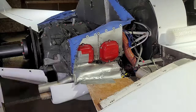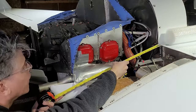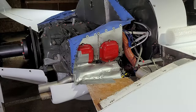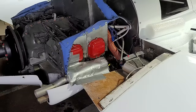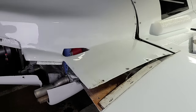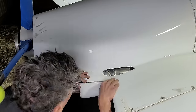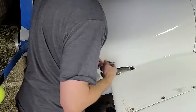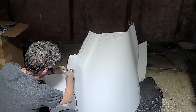So that's exactly what I did — I went home, had some dinner, came back. Now I'm putting some bubble wrap covered in duct tape because I want a little bit of space; I don't want the cowl touching that heat shroud. I want to make sure whatever I set up, there's going to be some room in there. I've done some measurements and I'm cutting a chunk out of the cowl and will test-fit it to see how good it is. I'm trying to do little bits at a time — I don't want to cut a massive hole. That one needs a little bit more, so we'll cut a little more, test again — and it looks about right. We'll go ahead and grind and smooth out the edges.